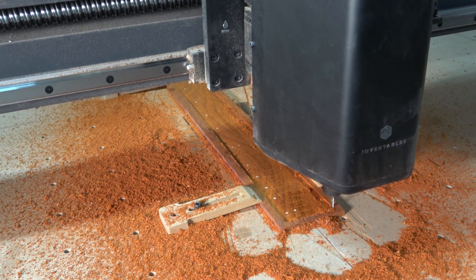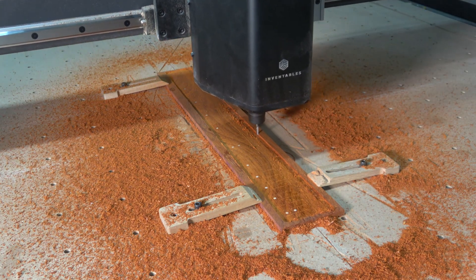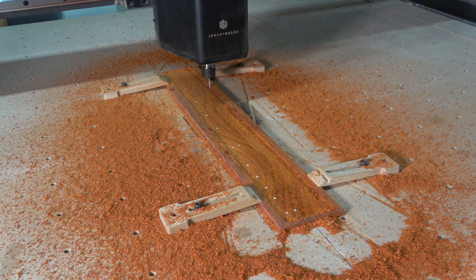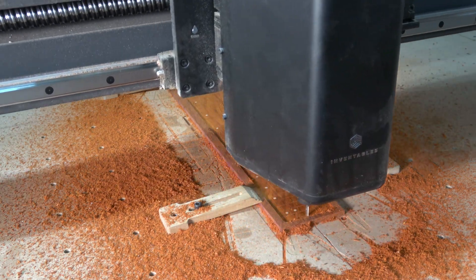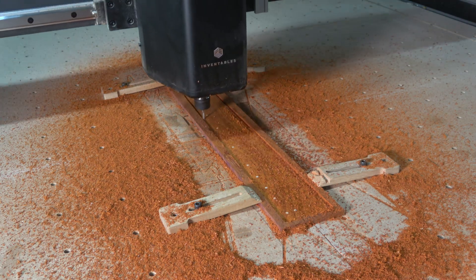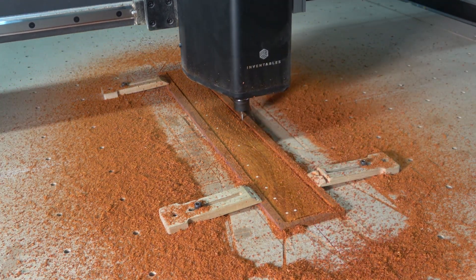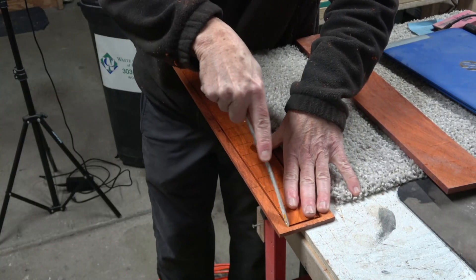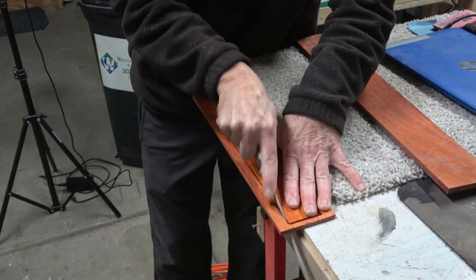The final cutting operation for making a fretboard on the CNC machine is to cut the perimeter shape. I'll do that with an eighth inch diameter two-flute spiral up-cut bit with a feed rate of 80 inches per minute and a depth of cut equal to the diameter of the bit. I also want to make sure I leave tabs so that once the bit has cut all the way through the blank, the fretboard doesn't go flying off the wasteboard and either suffer damage, break the bit, or become a lethal missile. Once that operation is finished, I can liberate the fretboard from the blank by cutting the tabs with a small hacksaw blade.